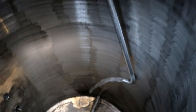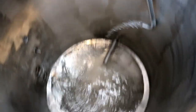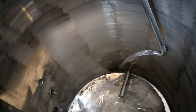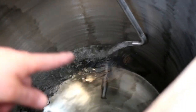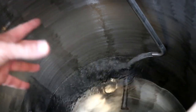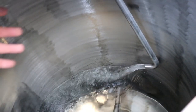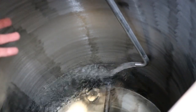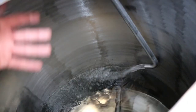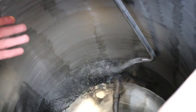This is the speed we've got on the boil kettle whirlpool arm. It's creating a whirlpool of sorts but the problem is it's a one-inch outlet and I'm running it through a half-inch pipe. I could throttle that one-inch outlet down to a half-inch and get a nice powerful jet, but as it is I don't think there's any real need to - because once we get the pump and all the pipework up to one-inch hygienic pipe we're going to be laughing. It's going to be coming out of a one-and-a-half-inch RJT fitting on the pump, so we should have the power. But the transfer into here is a heck of a lot quicker than filling off the mains.